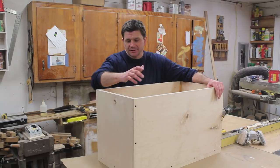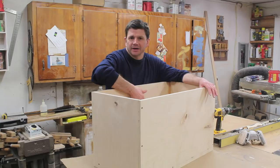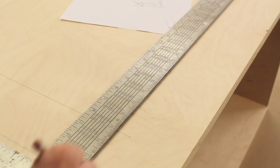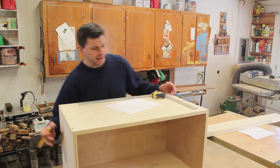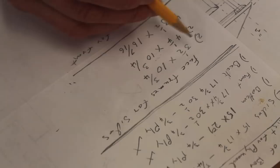Now that I've finished assembling the box I'm ready to move on to the face frame. I wanted to mention that the inside of the box is going to get a clear coat and the outside is going to be painted, so I made sure to use the good side of the plywood on the inside. I've taken a minute and drawn out the panel in the center and on the sides, and from there I'll make a cut list. I've finished the cut list and now I can start to mill all of the parts I'll need for the face frames.